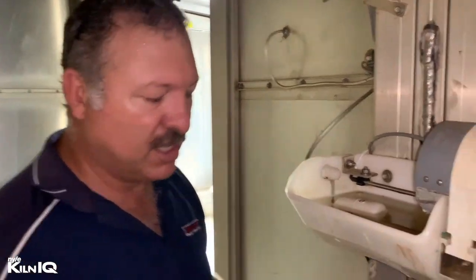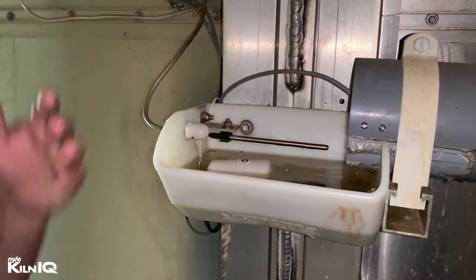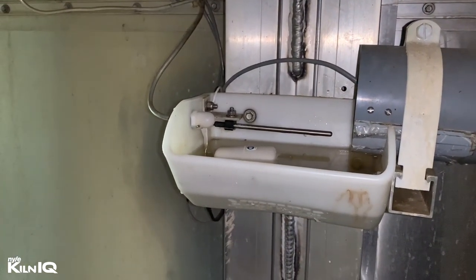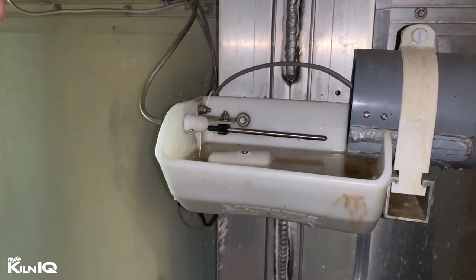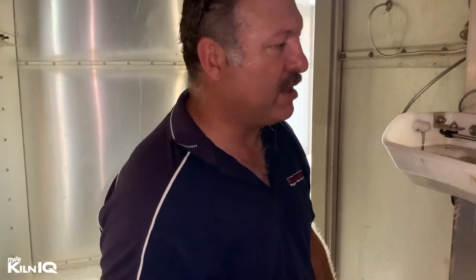This is the wet bulb position, and in terms of where your wick is, I personally like to keep my wick between 30 and 40 millimeters above the water level — that works for me. Some people may take it a bit higher, but the higher you are above the water level, the greater the chance of your wick drying out quicker.